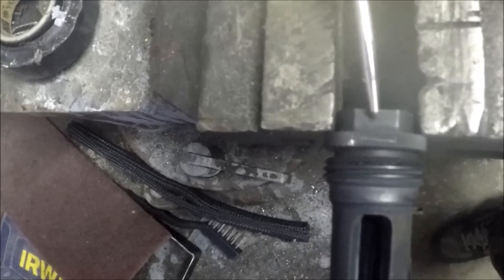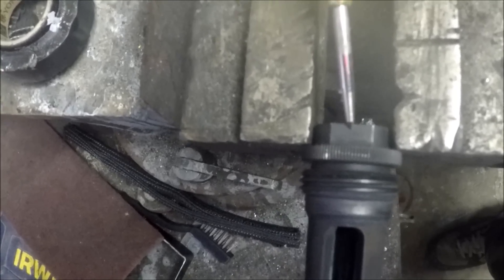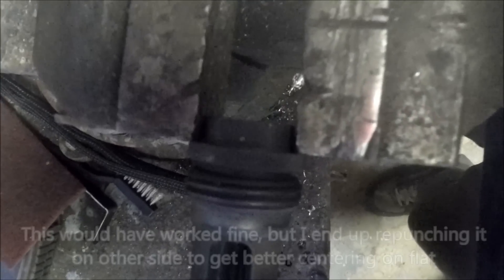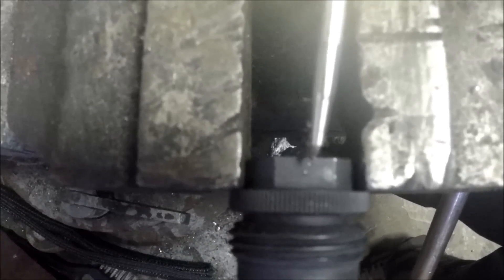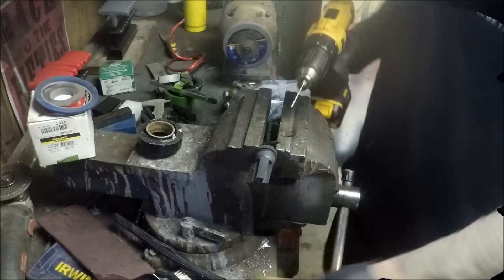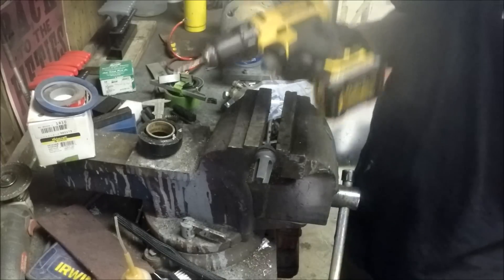Let me show you what part we are going to drill. I have it chucked up in the vise on the rounded side, which isn't ideal, but it's going to be easiest to drill here on the flat part. So I'm going to use this center punch to make my hole. It's not perfectly centered — I've gone ahead and redone it off camera, and as you can see, this center punch hole is a little bit better centered. So now I'm going to get my drill bit and get the drill in this sucker.